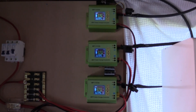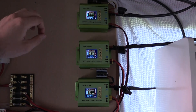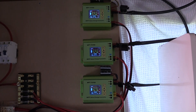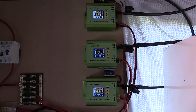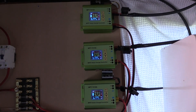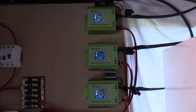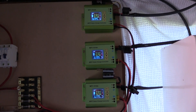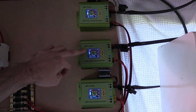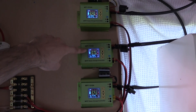As you can see, this one here is up to 340 watts, and the top and bottom ones are over 300 watts, which is good. I would expect them to be a little bit higher. The one thing I've really noticed is that what you set the panel voltage to be is really important — if you set that too low then it'll constantly drop out.